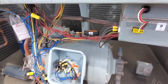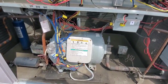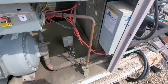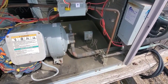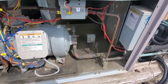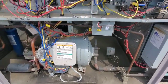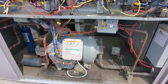I went downstairs - there are two air handlers and two solenoids for this one condensing unit. The customer was in the kitchen area so I couldn't take a video. Both solenoids for both air handlers are not energized. I put my screwdriver on top - usually you can feel the magnetic pull and hear them humming - and I even put my meter on it to check power: no power. The solenoids are not energized. I called our controls guy; he's going to go on the BAS and look into this further.